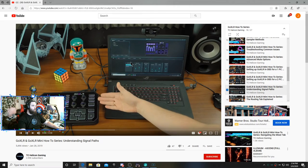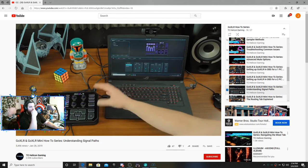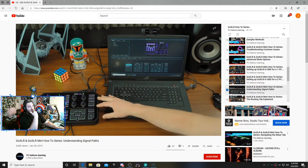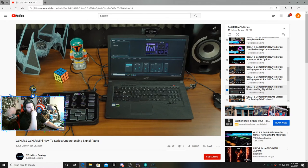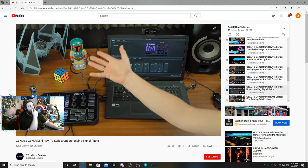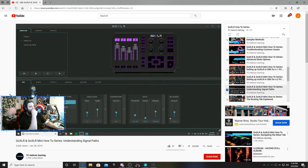We have in our first stage a limiter, and a limiter makes sure that the level that's coming in doesn't get too loud to the point where it distorts. From there, it starts going into the processing, and the processing happens onboard GOXLR in our DSP chip. DSP stands for Digital Signal Processor. Okay, so the signal's been amplified or boosted up, and now it's inside the processor. And then it goes through the various stages of control over the sound, like your equalizer, right? So how bassy and trebly is it?